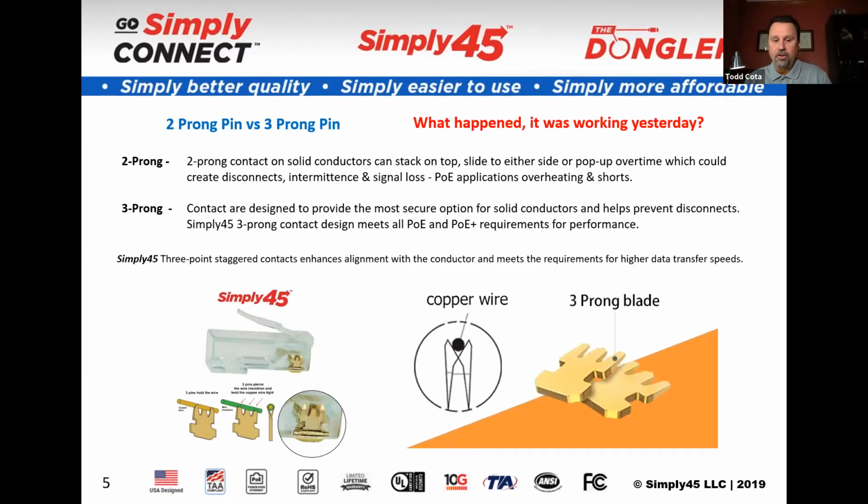So one of the things that we did is we did a three-prong style contact that has an offset middle prong where it locates the conductor every time. So it's going to find and locate that conductor, and then you've got 3 points of contact. So it literally is one of the most secure contacts in an RJ45 that you can get. Obviously that's where you have improved bandwidth speeds, and it eliminates a lot of the digital fallout that typically could happen in your installs.